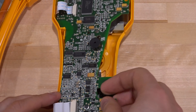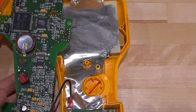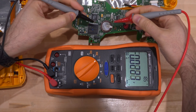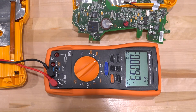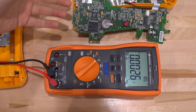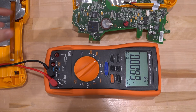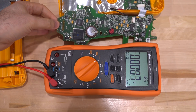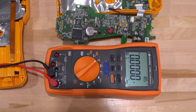I'm going to measure the backup battery to see if it has anything left. Let's measure this battery on the motherboard — it's at about 1.9 volts. This is actually a rechargeable battery soldered to the motherboard, and I believe it's reading 1.9 because I just put in fresh double-A batteries and it's probably recharging. I'm going to leave it alone. Let's clean it up a little bit and put it back together to see if it works.